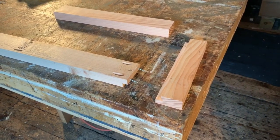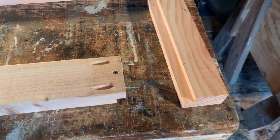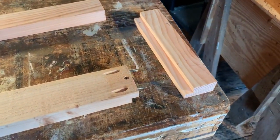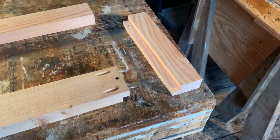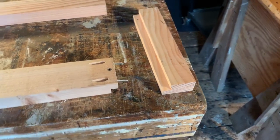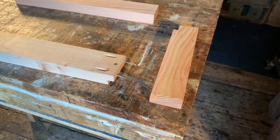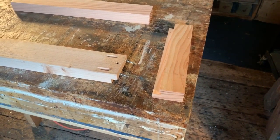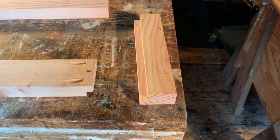material. It's not a fine furniture joint because of the exposed pocket holes and screws, but it is the next best thing to doing a traditional type mortise and tenon joinery. But if you have utilitarian type woodworking to do, you don't really need the overkill and effort it takes to make mortise and tenons. So this joinery method is just a couple quick cuts on the table saw.